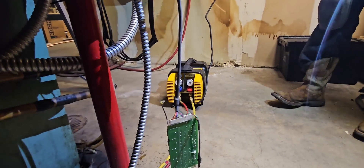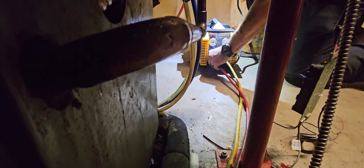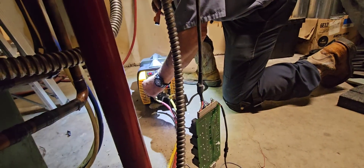We got down here a couple of strainers — circuit one in the back, circuit two in the front. We're going to be pulling from circuit one, going into our recovery machine, coming out on that yellow hose, and pushing it into circuit two. Going to open both of those valves — the little dial-looking switches — and that's going to bring us pressure. I'll purge everything right here. Got a lot of oil in there. I've purged all of these hoses going all the way through the recovery machine and all the way back.